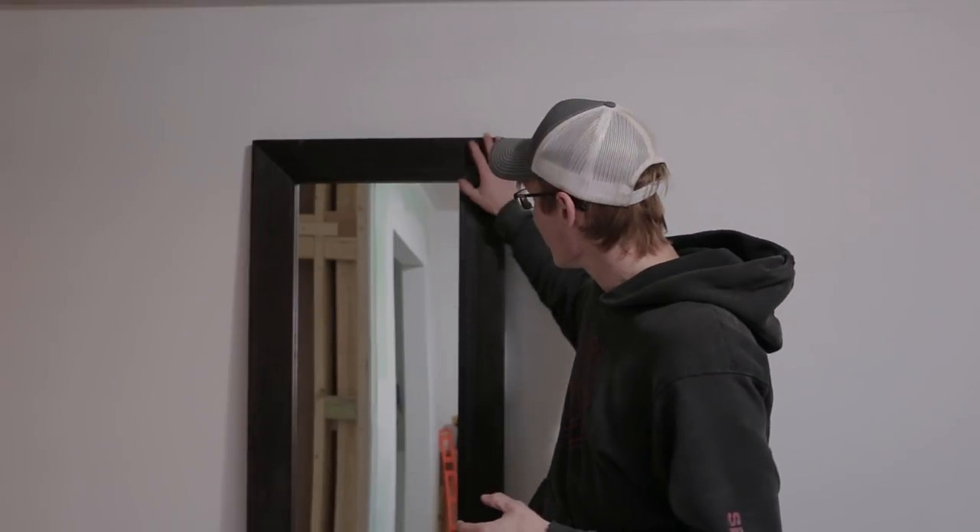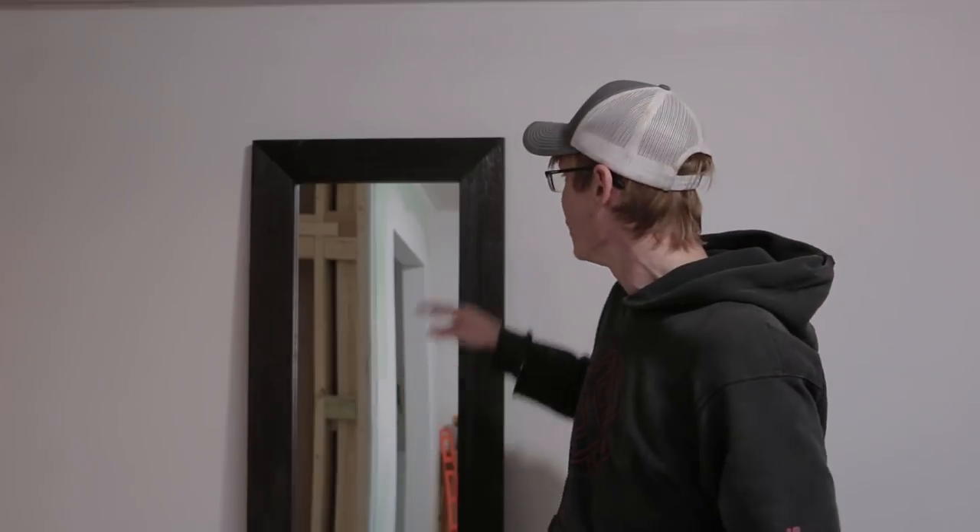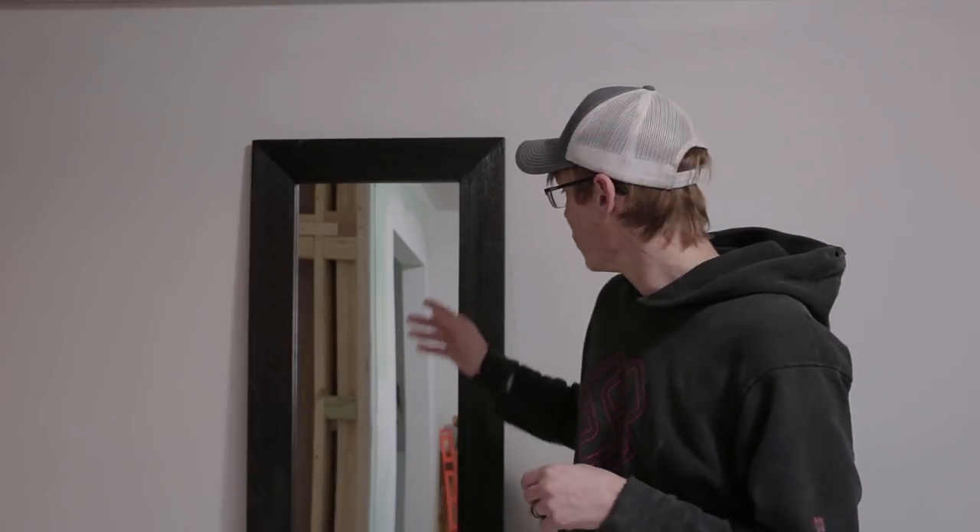When we were at the store, I went back and forth. They had several nice art pieces, very similar in size to this mirror. I ended up selecting this mirror because it's got a 4-inch frame, so it gives me something solid to connect into, and 4 inches gives you a lot of leeway. I could put hinges on it and have it hinge out, or use the drawer slides. This mirror is 22 inches wide and the wall it's going to mount on is 30 inches, so we'll have to pay attention to centering it. The cubby it's going to cover is 16 inches wide, so this mirror will definitely do that — it gives a little buffer space on both sides.